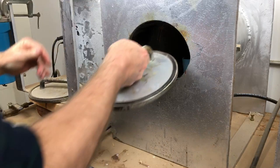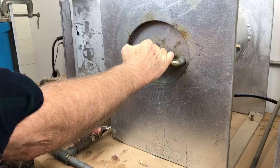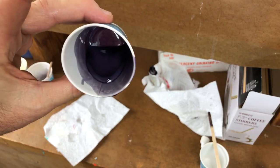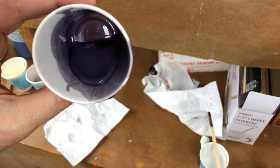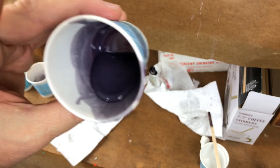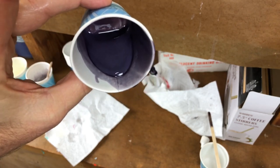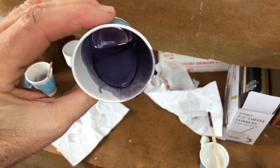Close the outlet valve, pop in the door, and away we go. That's our witness cup — this is the leftover resin, and this cup will tell us what's going on in the tank. You can actually see it starting to kick — see how it's going light? It's pretty dark in the liquid pre-cured stage, but it's going to cure to a lighter gray, which it's already starting to do. See how it hardly runs anymore? It's at the gel stage. You keep an eye on your witness cup and that tells you exactly what's going on inside your mold. Once this is 100% hard, you know you can extract the mold.